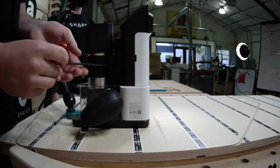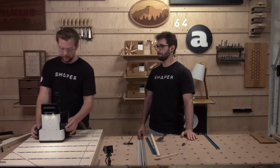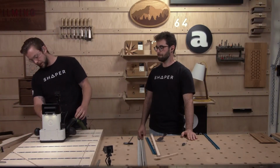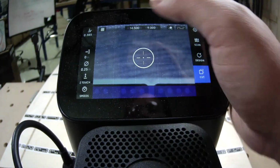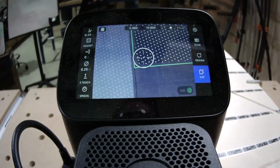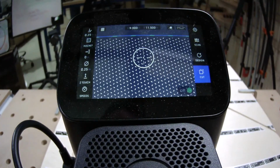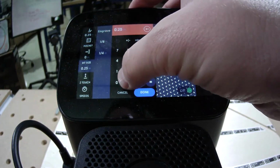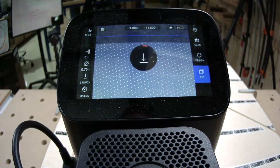Yeah. I'm going to be doing a 1/4 inch. And it feels okay. I'm going to put my speed down to about 4 and my offset to 0. Depth at a 1/4 inch. All right. So I'm taking out this big pocket back here. What's the first thing I need to do? Tell Origin that I have a 0.75 inch cutter and Z-touch.